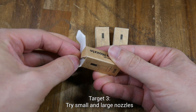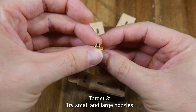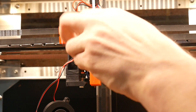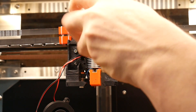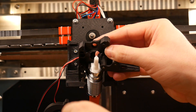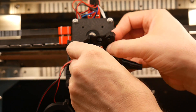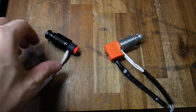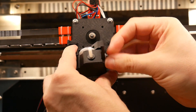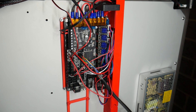Since the nozzles are interchangeable, I'd like to print with a 0.4mm nozzle but also smaller and larger nozzles too. Most printers will start by disassembling the factory extruder and hotend. This printer runs a BMG clone, so all I need to do is unbolt three screws, pull out the old hotend, and fit the Revo 6 as a straight swap. Assembly is just the reverse, with the wires happening to be the perfect length.